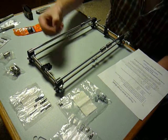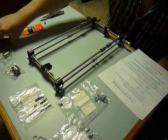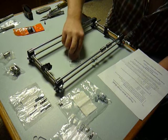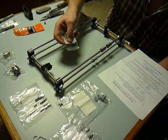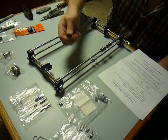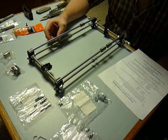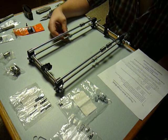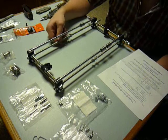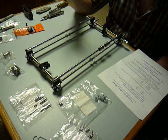While I was there, I also picked up screws to mount my power supply. I was also shorted a couple of M3 by 16 millimeter screws — they happened to have those there. Those are metric. The power supply is metric; 5/16ths is clearly standard. So my printer isn't quite as classy anymore because I do have this one standard thread that's not stainless steel compared to everything else.